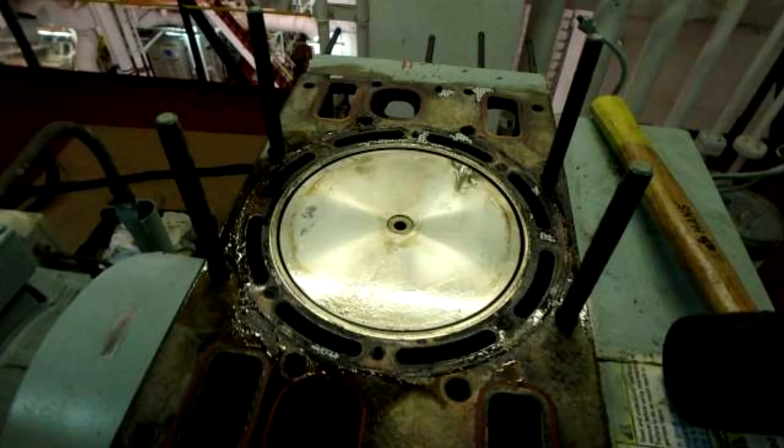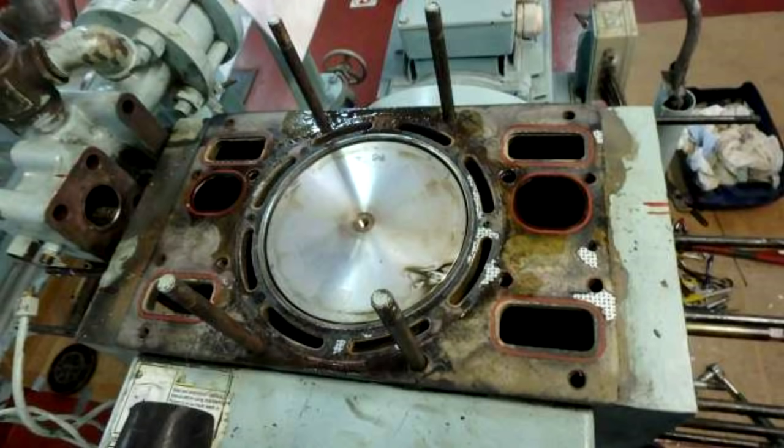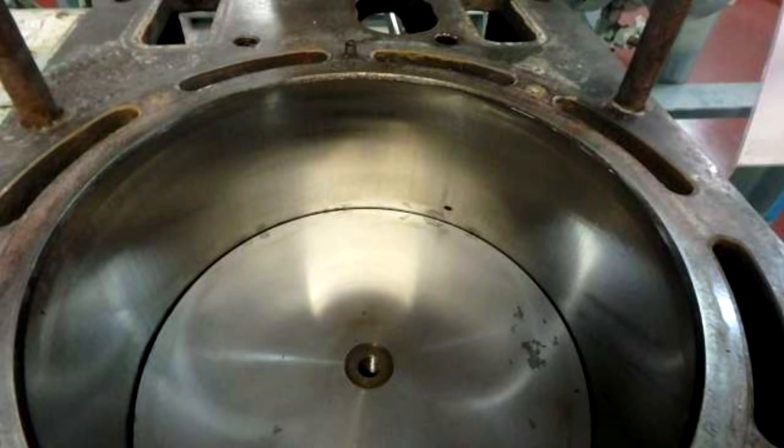And if there is any roughness, any unbalanced surface, it's better to apply a sealing compound or some silicone for proper sealing. We do not like any water or any moisture to be mixed inside the compressor chamber, because as you can see here, there are a lot of passages on the top, and in any case we do not like the water passing to the air or the air passing to the water. So we can see the piston here and the liner, which is in very, very good condition. You can see the hole, and through that hole the lubricant oil is injected through the lubricator.